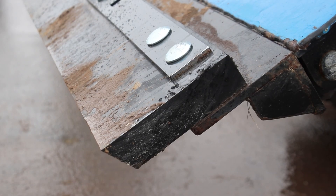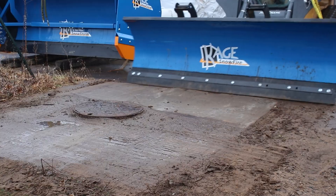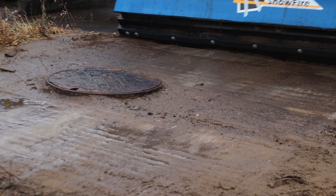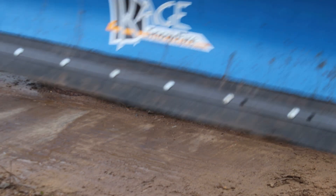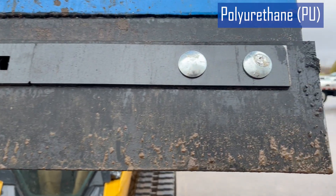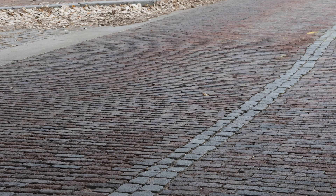So what makes polyurethane better than its polyethylene counterparts? Let's start with impact resistance. Polyurethane absorbs impact better than polyethylene, making it ideal for situations where there are frequent hard contacts with debris or rough surfaces. Polyethylene is more brittle and prone to cracking under heavy impact or extreme pressure, making polyurethane a better option in areas with frequent hard contacts with debris, rocks, large ice chunks, or uneven surfaces.